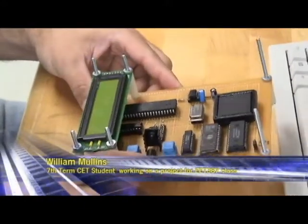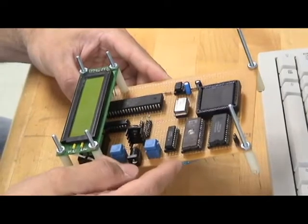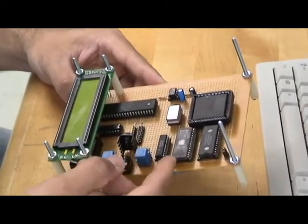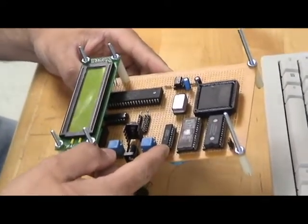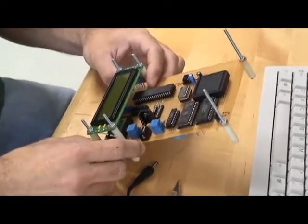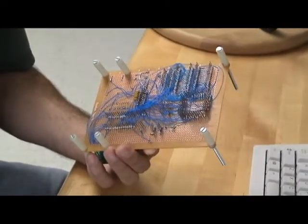Well, the project's an embedded controller. It's an Intel embedded controller, an 80C188EB. My particular version has a 64K EEPROM, 256, which would be a 32K RAM chip. It's got a 74LS373, which is a latch. Uses an 8255 programmable peripheral interface. Got your clock. You have your reset circuitry. It's all wired together, kind of a jumbled mess on the bottom.